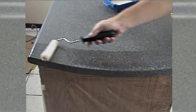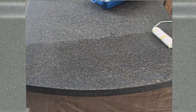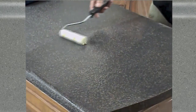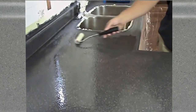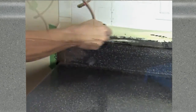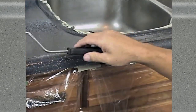Roll on the clear coat material with slow, gentle strokes. Apply the product moderately and avoid excessive pooling. Pass over the wet coating a few times to ensure uniform distribution. To avoid trapping bubbles in the finish, don't overwork the clear coat after it's been applied. Otherwise, this is just the same simple application as the rest of the countertop system. Once complete, your stone finish will be locked beneath a clear, tough shield. This is the last step in your countertop refinishing process and it should not be performed until the stone coating has been allowed to cure for at least 24 hours. Use your small brush to gently cut in edges and corners and continue until the surface is completely covered.